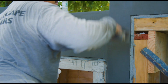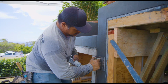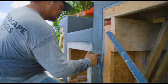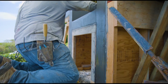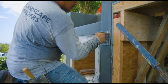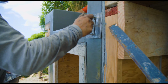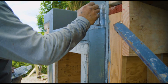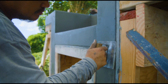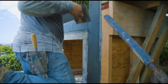And as time just ticks away, it's just more and more troweling and edging. The surface is going to get tighter and tighter, and it's also going to get smoother and smoother. This is at the point now on this particular shot, we're using a little bit of water in addition to cream just to give the edger a little lubrication so it's not binding or tearing the concrete. As the concrete gets harder and harder, it's going to want to tear or pull. So you have to either use more cream from somewhere else or our bucket of slurry or a little bit of water just to keep it so nothing's getting pulled.